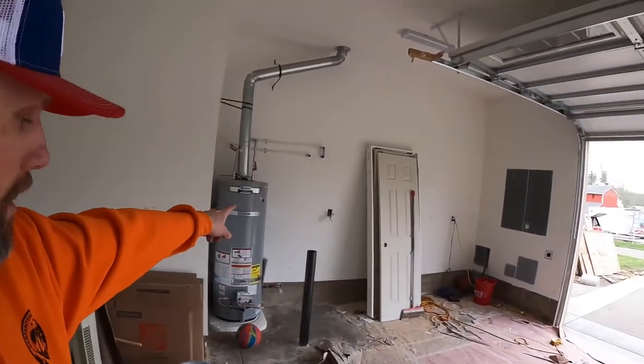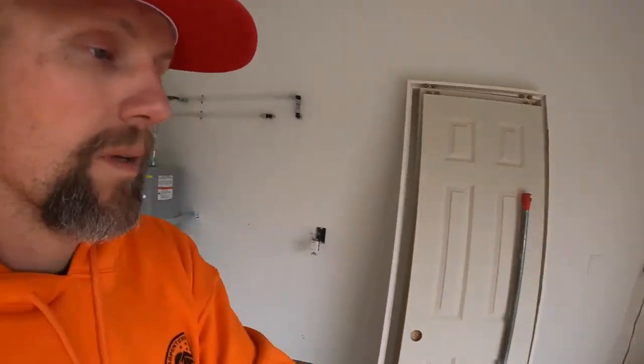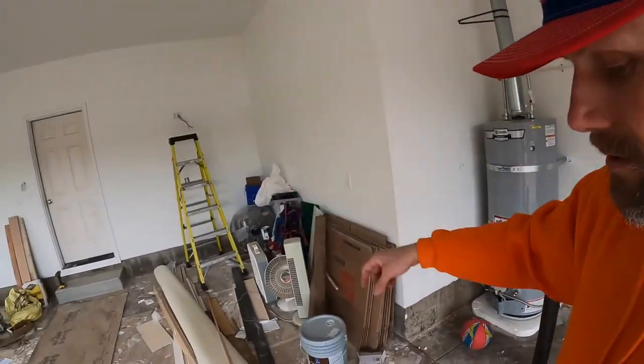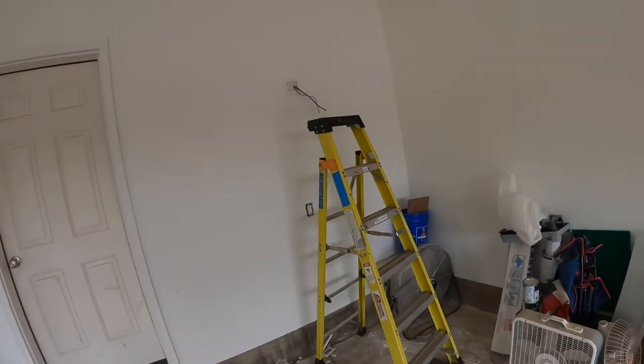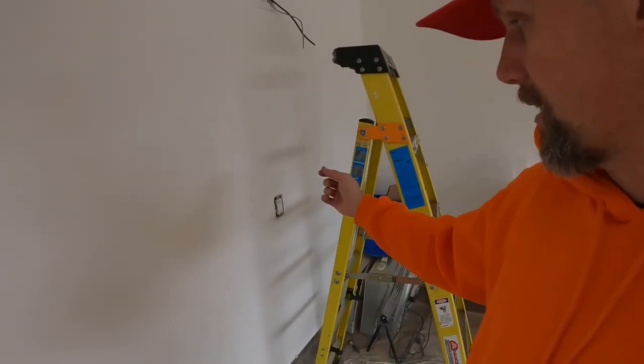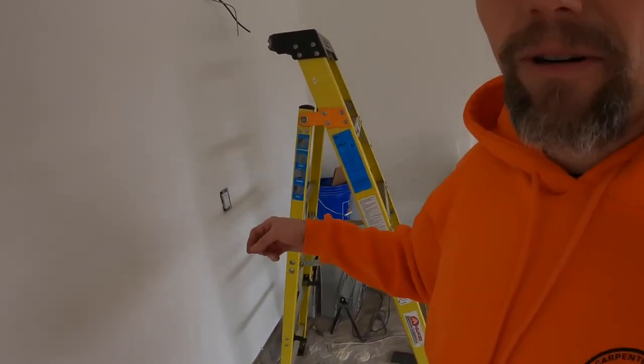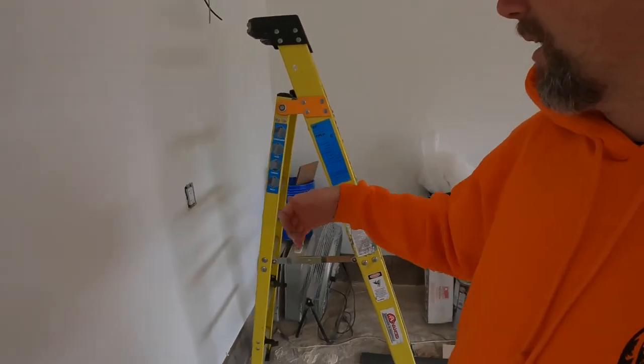And then lastly, the troubleshooting out there in the garage. So as you remember from the very beginning, that GFCI, as soon as I tripped it, popped the breaker. Well, what it was is back over here. I actually replaced this outlet here, but there was a nick in the positive wire, the load wire, the black wire. There was a little nick in it from them routering out for that electrical box. Well, that was touching the ground and therefore caused a short and that sort of thing.